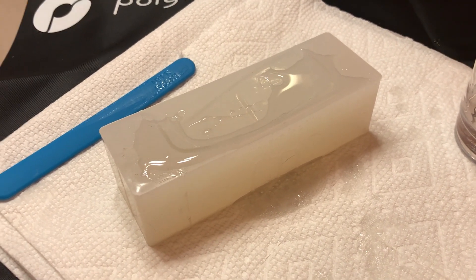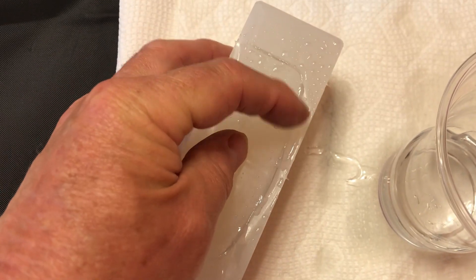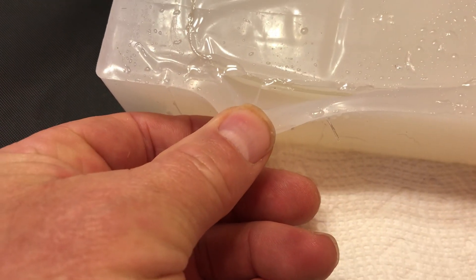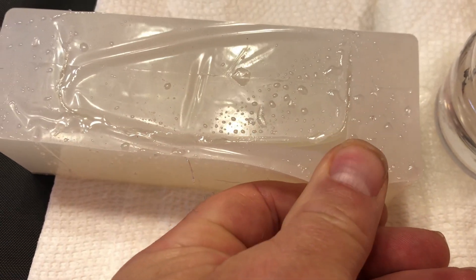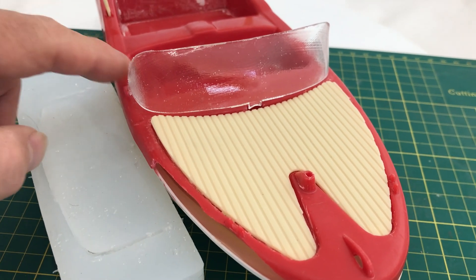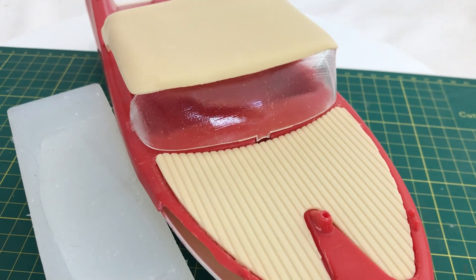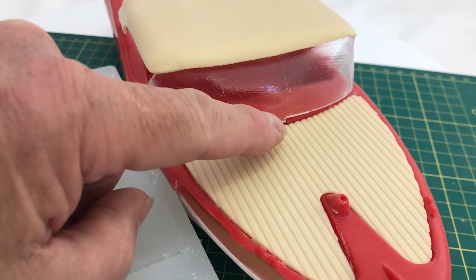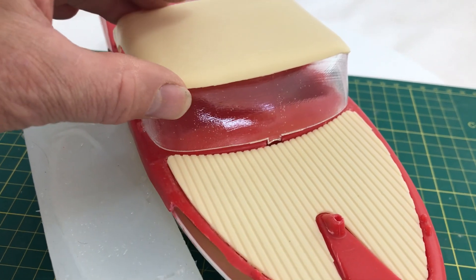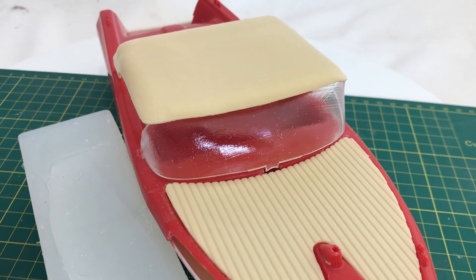The leftover turned really hard and the little pieces seem like they're hard too, so I'm going to try to remove it from the mold. It seems like it's detaching — I'm going to work it around. When I took the part out of the mold it was still a little soft, so I stuck it in the old boat model I have here just to check the fit. It fits pretty well. I did notice that pulling it out I broke a piece off the bottom, and I also have some air bubbles in it, and it's picked up the texture of the 3D print I used to make the mold with — so we're going to have to make a better original part.